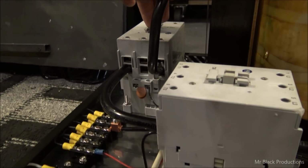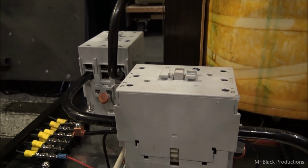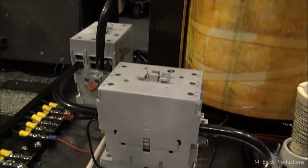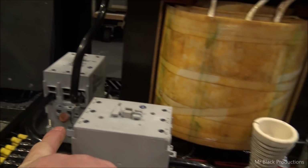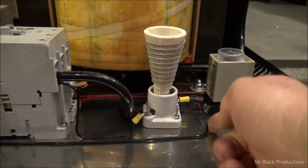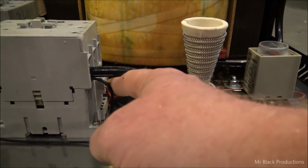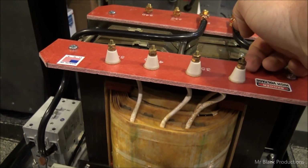Soft start circuit works like this. I call for this contactor to latch. This contactor latches, and it takes one of the phases of 220 and runs it up to the 220 volt tap on the primary side. Your other 110 volt leg out of the 220 comes around and comes to this 100 amp contactor. Okay, this contactor sits open. Now the electrons have got another pathway they can go. They can go down, come up, go through this conical heating element, back down, up, then back out this leg, and back around and up to the other side of the primary.